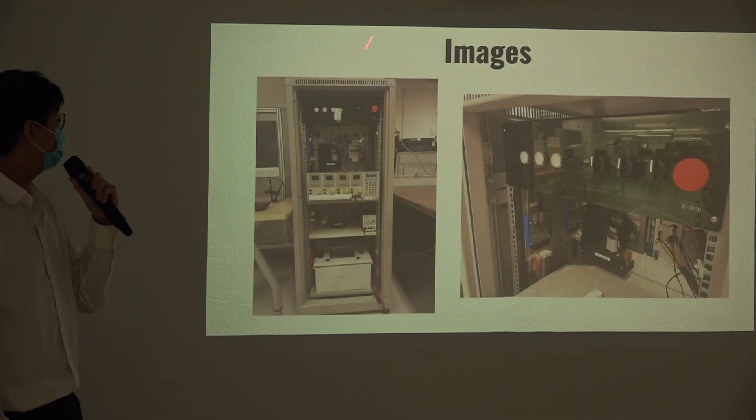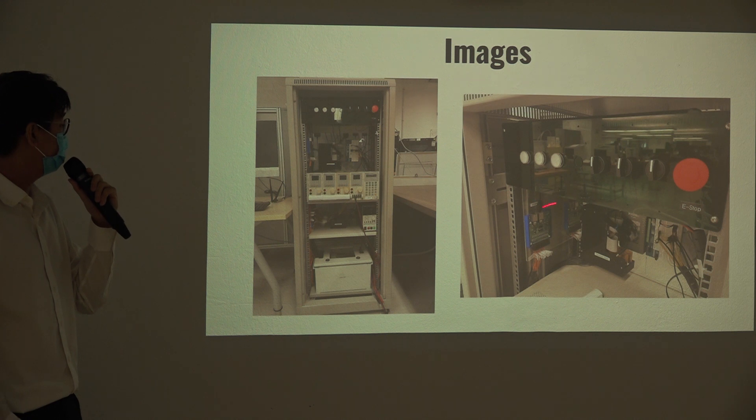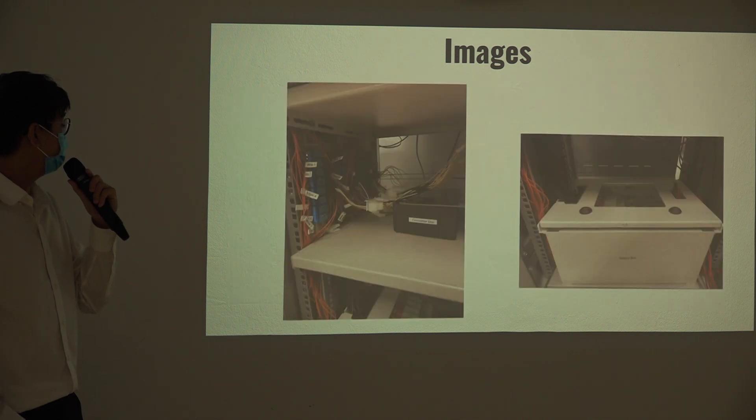These are images from the cabinet itself. The acrylic board is laser cut and was designed by the team. It holds the board capable of monitoring all the cells. The battery board has thermistors pasted on the surface of each cell. Also shown are the smoke sensor, temperature and humidity sensor, active balancing board, fan, relays connected between the batteries and the voltage management board, and the battery box.